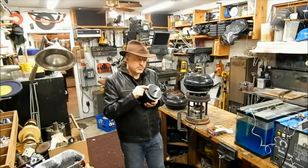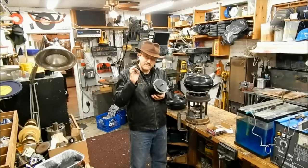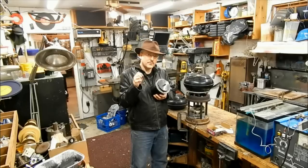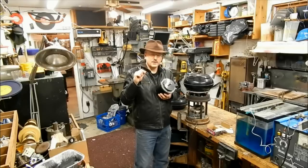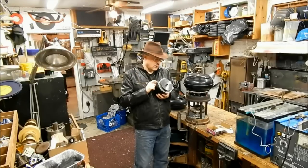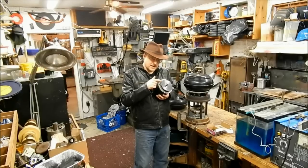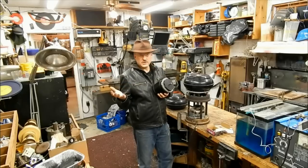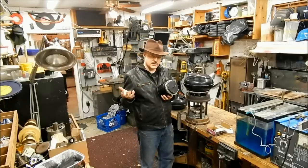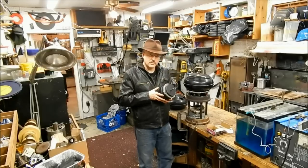And this is something that I think 3D printers are really, really good for the tinkerer. Very often there'll be some little problem where you need a specially shaped piece to retain a wire, or you'll need a clip to hold something in place, or you'll need a fan like this. And this I designed up in about 10 minutes in Autodesk's 123D software, exported it to an STL file, started printing. It took like 3 or 4 hours to print, but that's largely an unattended process, and I got just exactly the little fan that I needed, and it worked perfectly for cooling the motor.